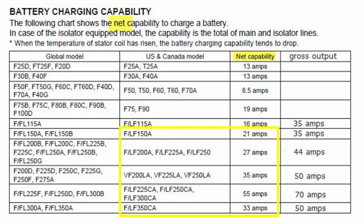This image illustrates an essential piece of research you need to do — figuring out just how much amperage your motor puts out. You need the net amperage, not the gross amperage. Gross amperage is what the alternator outputs, but some of that is used for running the engine, so you want the net output available for charging the battery. This particular chart is for Yamaha engines. If you're running Suzuki, Mercury, or something else, you'll need the chart for your engine. Also note that on the Yamaha, the auxiliary charger only cuts in after the batteries are charged on the primary circuit. Other engines, I believe, are different — some manufacturers actually split the voltage between the main and auxiliary circuits, with basically a VSR in there to control which one gets the charging voltage.